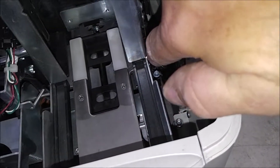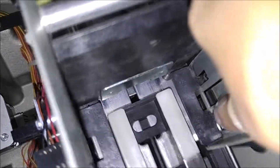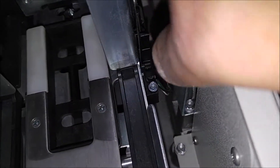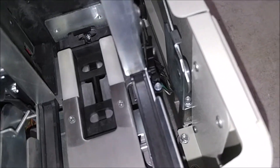It has six sensors on this hopper. This is the output empty sensor. On the inside here it's got this little tab — when the cards go down, it pushes that tab in, which pulls this flag out from that sensor down there so it tells it there are cards. When that tab goes into the photo cell sensor, it tells it that the cards are empty.